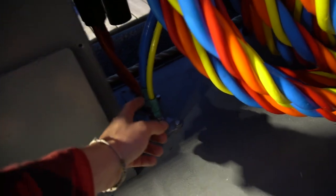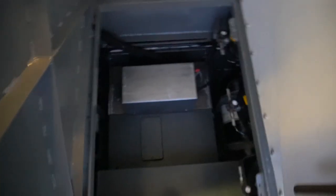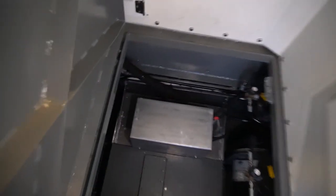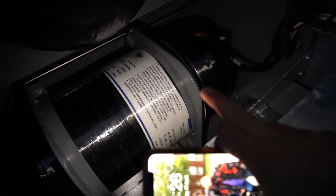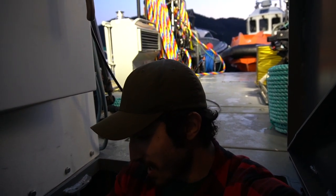Now you might think: where does this air come from? Obviously it's travelling from here to the diver, but where does it originate? Let's go two steps back. On this boat we have the cylinders — I'm going to open it up. It's a little bit dark down there but I'll show you using my phone light. We have three cylinders on the main tank, three cylinders on tank number two, and two backup cylinders. So in total we have eight cylinders: three on the main bank, three on the second bank, and two for reserve or emergency use. The air is stored in these high-pressure gas bottles — they are 49 litres each and are all pumped up to 200 bars.